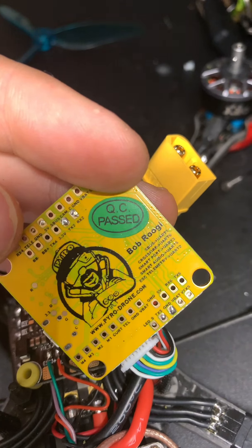I have this other flight controller with exactly the same pinout and it works, so I don't think it's the ESC. I was measuring the voltage on here and it's 16.8V as well, so it's supplying the right voltage. The harness is connected exactly how it should be, so I really don't think it's the ESC.